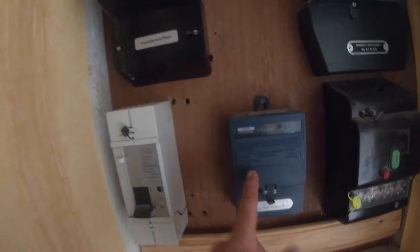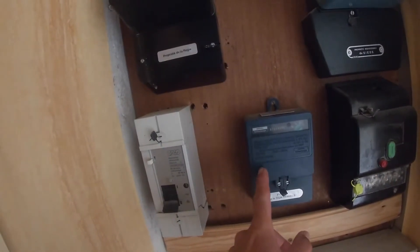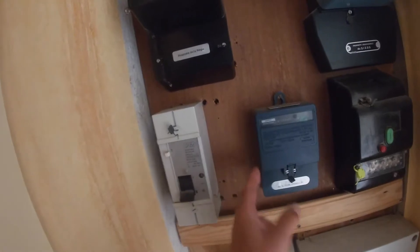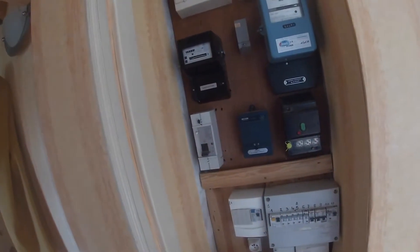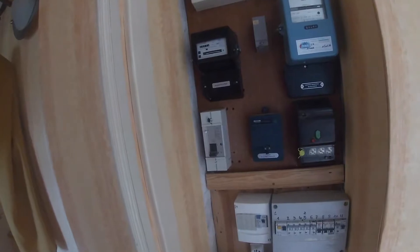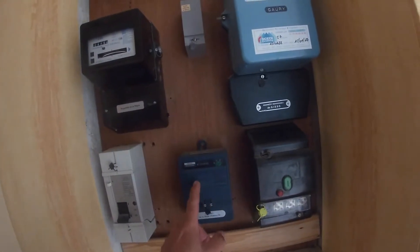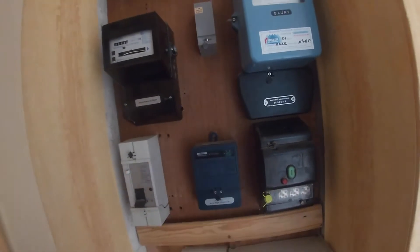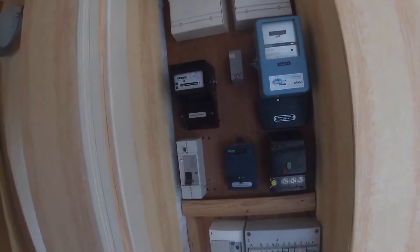This here receives a signal sent by the electric company down the electric wires at about 10 o'clock every night and 6 o'clock in the morning. It picks up the signal and operates a switch, which you use to turn on and off hot water heaters or things you want to run on cheaper electric — a bit like Economy 7. If you don't have two types of pricing on your electric, you don't need to worry about it.